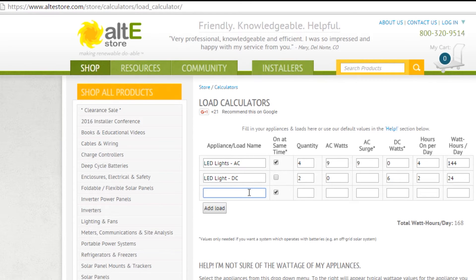Now I've actually used a kilowatt meter to determine how much power my refrigerator uses, because the refrigerator is difficult to calculate based on its ratings — it's going to be on and off at different times of the day. When it comes on automatically, it's got a bit of a surge as well. So I used my kilowatt meter — and we did a video on how to use a kilowatt meter, so you can check that out. My fridge: I've got one of them, and it uses about 85 watts when it's on, but it does have a high surge — the compressor, when it turns on, surges up to about 300 watts. I'll put that in there, so when I calculate what size inverter I need, I'm going to take that surge into consideration, because an inverter is rated both on its continuous power and its surge. When it's on and drawing those 85 watts, it's about half the day, so it uses just over a kilowatt hour a day.